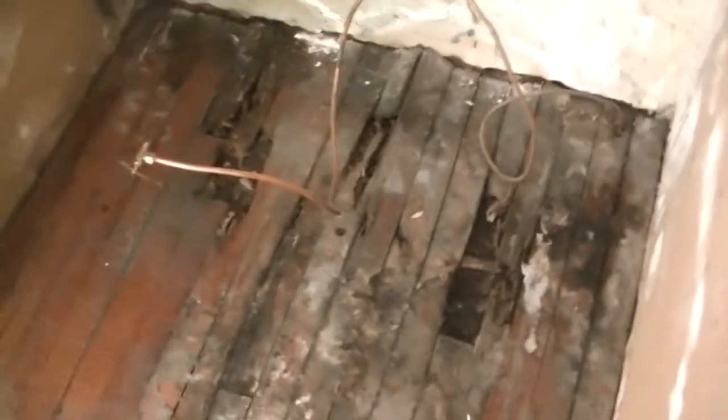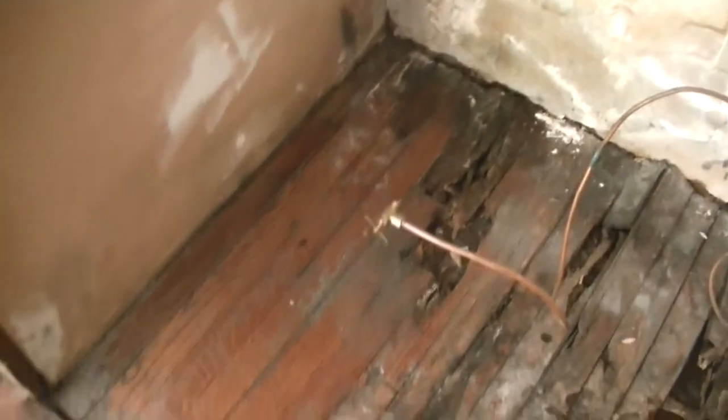I'm back at the old Nikki and John house. The floor here has been wet and it's been wet for a long time - I would say this started before Roger died. It's because of this copper pipe that was run out through the floor; it shouldn't have gone through the floor, it should have gone through the wall, and it had no emergency cutoff. I had to put one on myself and go to the street to turn the water off. I'm going to try to cut this out and replace it with some wood I have.